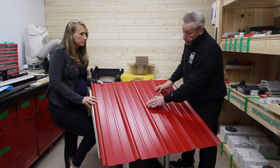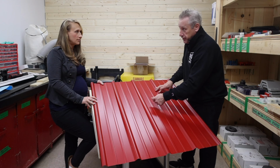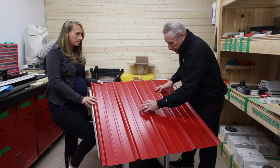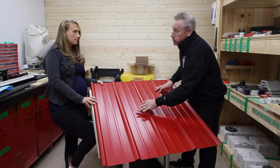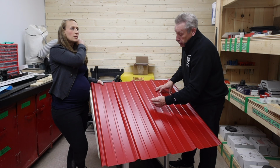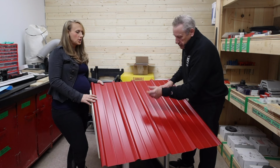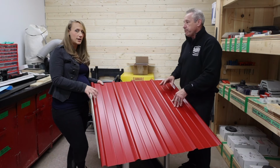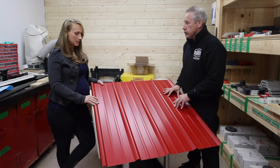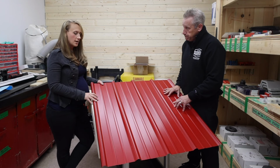Yep. And in the rib, for that same matter, and this happens a lot, people drill through here and they're worried about it not being tight enough. Then when they crank it down, it'll actually push down and bend the metal, and you'll see a little kink in it or a smile. You can try and back it off and it might just be fine. If it's not, it's not, but you're not hurting the steel there. It's just something not ideal. You want it to just be snug. Exactly, feather it in. Near the end, just a couple more taps and you'll be okay with it for sure. Absolutely, that's a really good point about the screws themselves.